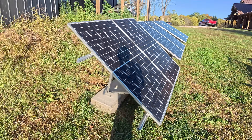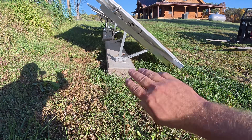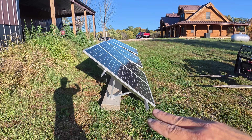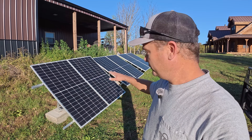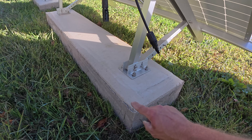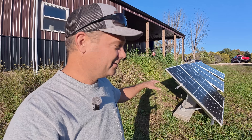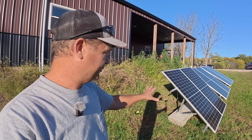I've got all three ground mounts on the ground, but you can see one is sitting very differently — that's mostly because the ground is curved here. As the ground changes, these are going to change the mount angle; it's not going to lay perfectly flat on uneven terrain unless you prepared the ground and made a level surface beforehand. The concrete form dimensions are 14 inches wide, 69 inches long, and 7.5 inches deep. That works out to about 10 sixty-pound bags of concrete, weighing around 550 pounds. Once you add the ground mount and the solar panels, the total weight is probably around 650 to 700 pounds.